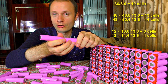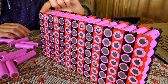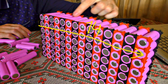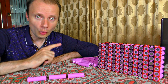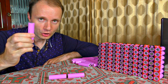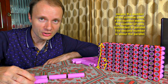Someone may need 12 volts for a screwdriver, for example — that requires 3 cells. You can clearly see that the negative plate is soldered to the positive plate in a zig-zag pattern, one after another in a row. Each cell has 2600mAh; if you want more capacity, connect two cells in parallel to get 5200mAh.